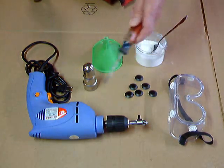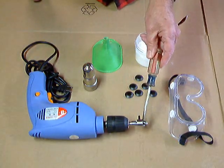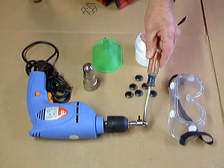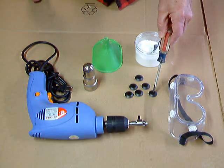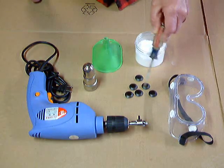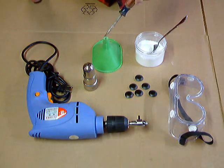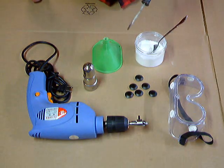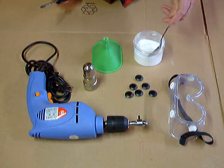This is where it gets different. You need an electric drill with a stop drill bit, which is set at a shallow depth so you won't drill through and hit the plates in the battery. You'll also need caps so that when you're done adding your chemicals and water, you can seal the battery back up again. You still need a battery post cleaner, a plastic funnel, and the additive — this is the China Depot battery additive.